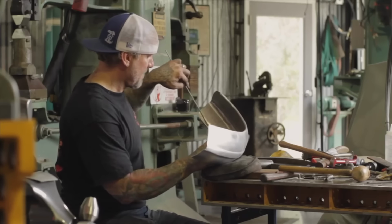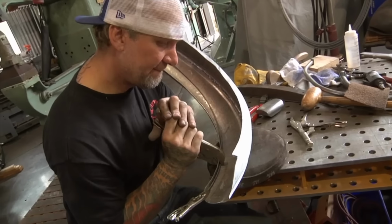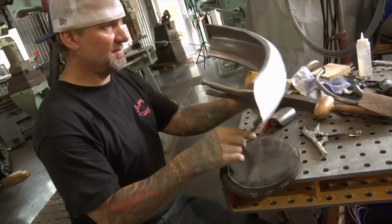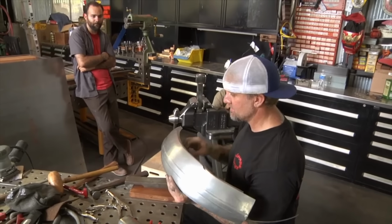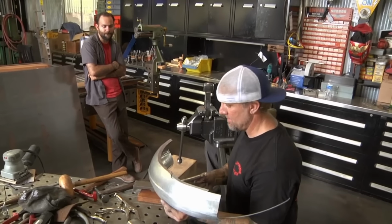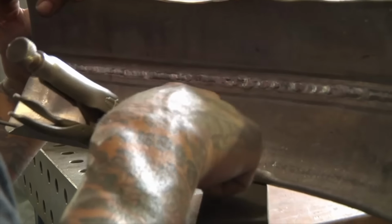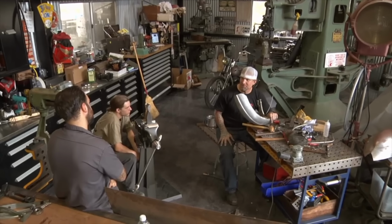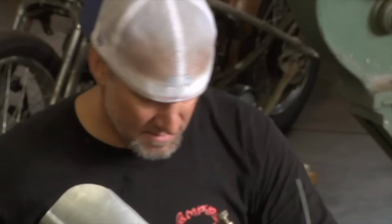This is just 10 gauge galvanized fence wire, the kind used for string in chain link fence. Same discipline, just go a little bit at a time. I'm hitting it over and then hitting it down, getting in there as far as I can at the best angle, and hitting it down so it curls onto the wire. I'm clamping it far enough away so I don't see any gap. People have all kinds of gizmos to do this, but this is the way that works without messing stuff up. It's labor intensive.